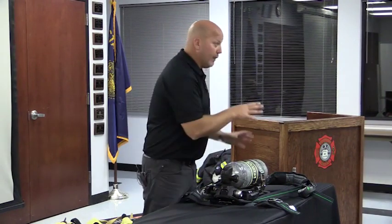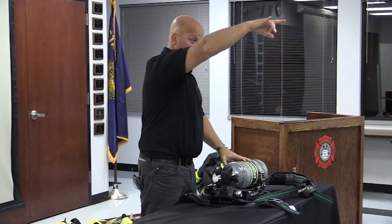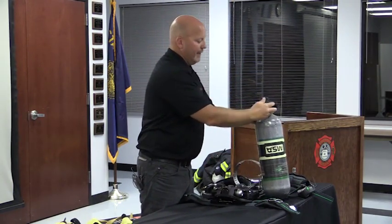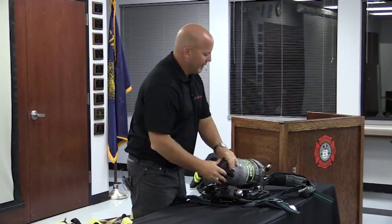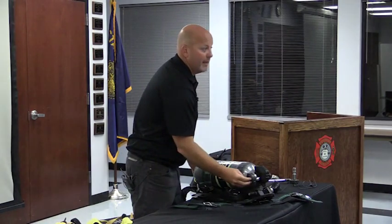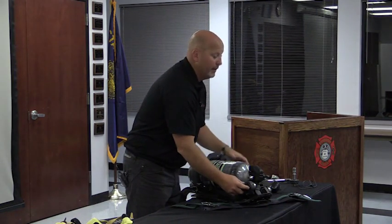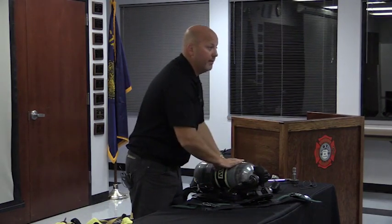Okay, so what you would have to do, if you've now taken my statement, what he's taken is a cylinder that's not my new G1 cylinder, it's my old Firehawk type cylinder. I would obviously have to do two things. First thing is I'd have to put an adapter onto the existing cylinder to make it work. If it didn't have a dovetail, I can still use it in the SCBA, but what I have to do is what I call hold load. What I mean by that is I can't just drop it in and everything's going to line up perfect. I need to make this connection first and then lock everything down. Does that make sense? Because you can't just drop it in and have it line up perfect, because it has no stopping spot without that dovetail on it.